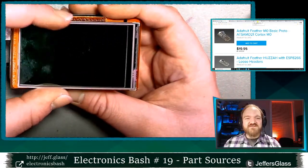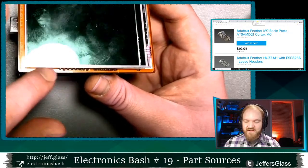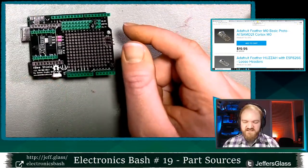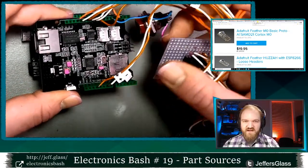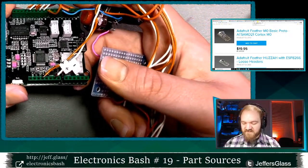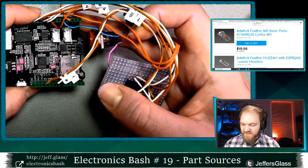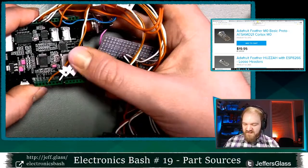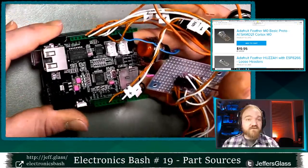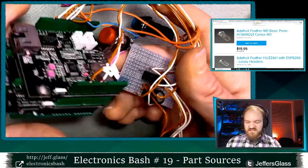So you obviously wouldn't be able to stack something on top of this LCD shield because it doesn't have those female headers on top. But a lot of shields do, because they don't want to limit your possibilities of control. Here's another shield. This is an Ethernet shield, which is actually still hardwired into a prototype that I was building with it. This might look a little familiar to Lee and Travis. This was the prototype of the SACN shield device that I was helping prototype for them. But similarly, I have the XB shield on there. I have the Ethernet shield now also stacked on top of there. And assuming they use different pins, or I can configure them in my code to use different pins, this is a totally valid thing to do.